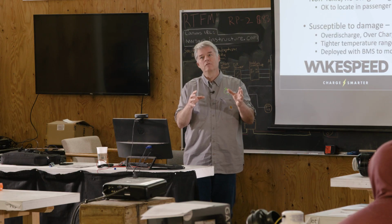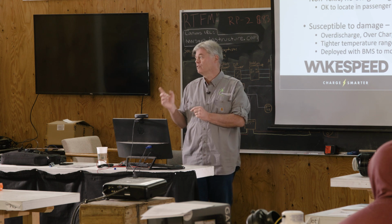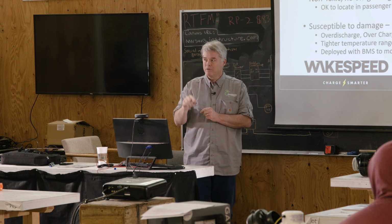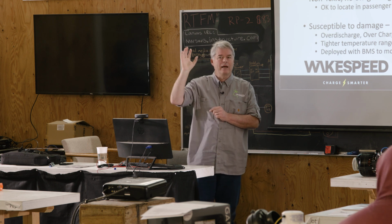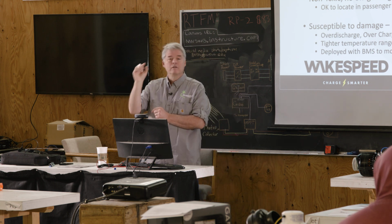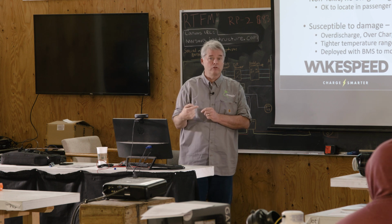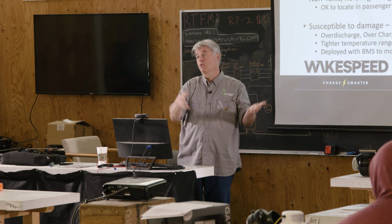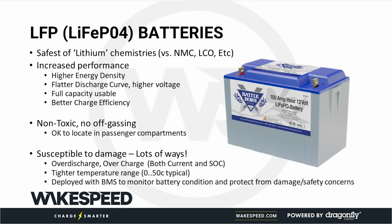one of the, going to the elephant in the room, the thing you hear about with lithium batteries, they catch fire, right? The thing that catches fire is largely the electrolyte inside the battery. Lithium iron phosphate, that chemistry, that combustion point, I think is like 430 degrees C, something like that. So it's a very high temperature. So typically lithium iron phosphates won't be the primary source of combustion. However, if something else starts fire and they raise that battery to over 1,000 degrees Fahrenheit, it will definitely contribute to it. The downside with lithium iron phosphate is their energy density is lower.